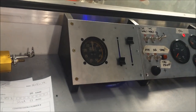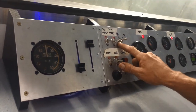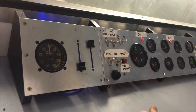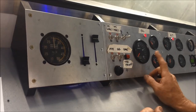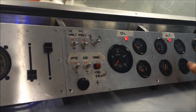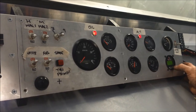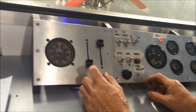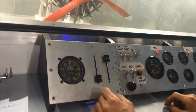Over to the panel - I haven't labelled it fully yet, it's not quite finished, but we'll get there. We've got oil pressure, alternator, magneto-1, magneto-2, engine selection whether it be the 9-cylinder or the 7-cylinder - in this instance it's the 9. I've got my main master switch operating a solenoid down on the engine frame, fuel pump, auxiliary fuel pump, TBI primer - that was the actuator you saw operating before. Then I've got RPM, oil pressure, oil temperature, exhaust gas temperature, alternator volts, fuel pressure, cylinder head temperature, and a flow meter which I normally keep on fuel flow. And if we run Jabirus with liquid cooling, I've got a water temperature and a water pump switch.